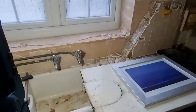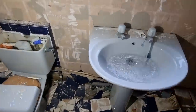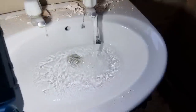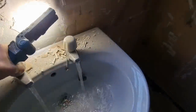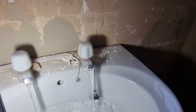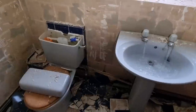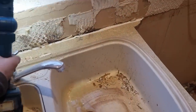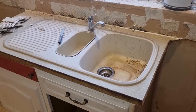All right, we've got the water off, but that tap in there, that could be tank fed, because it used to be a care home, so it might be that the toilets and basins. I think he's opened the hot tap there. I think that's the cold tap. Looking at it, it's probably the wrong way around. We'll have a look what's going on anyway. We'll have a look up in the roof and stuff. That cold is off. It must be tank fed in that bathroom. So we'll have to pick that feedback up somewhere in the roof. We can just link it out.